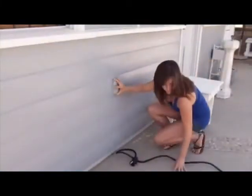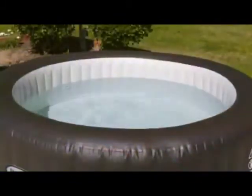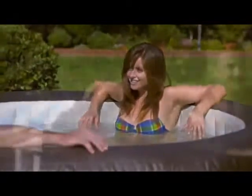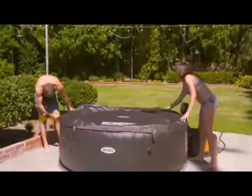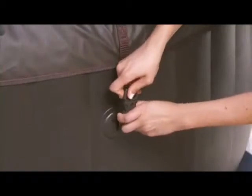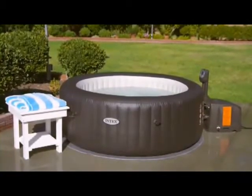Always unplug the spa for servicing or maintenance. Refer to the maintenance section in the owner's manual for details. Change the cartridge filter every week and the water in your spa every 2 to 3 months. The built-in hard water treatment feature works automatically when the filtration pump is operating. If your spa model includes a built-in salt water system, see the owner's manual for instructions. When the spa is not being used, always attach the cover and lock the buckles. A properly covered spa avoids potentially dangerous situations and keeps children out of the spa when supervision is not available. To secure the cover, pull all the buckle straps tight and lock the buckles with the provided key. Maintain a safe spa and enjoy years of happy use.